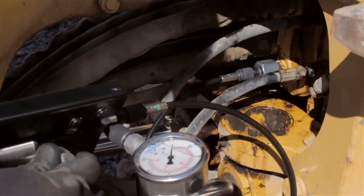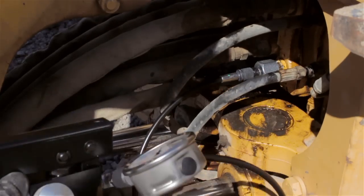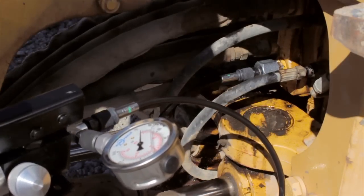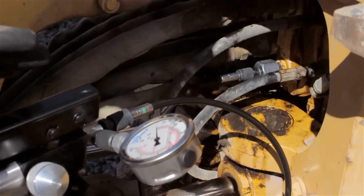The micro leak tester is ready to be used to test this valve. It has a valve to shut off the pressure gauge, rated zero to 3000 PSI. I'm now ready to pressure leak test into port A, the suspect port of this valve. Bear in mind that this machine is not running — it's locked out, it's chocked, it's blocked, and it's safe for troubleshooting.